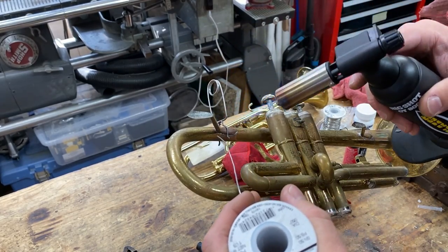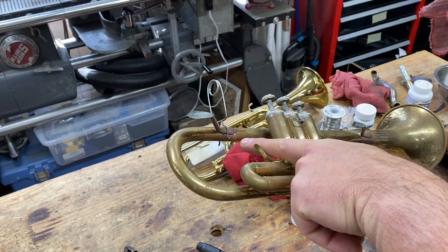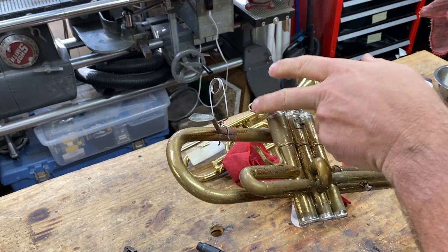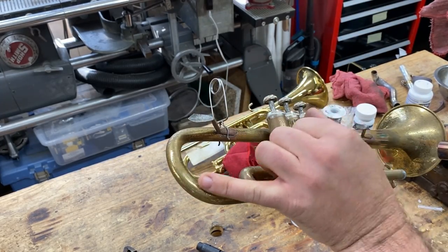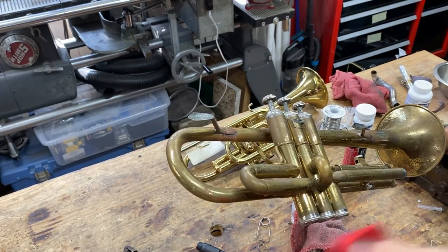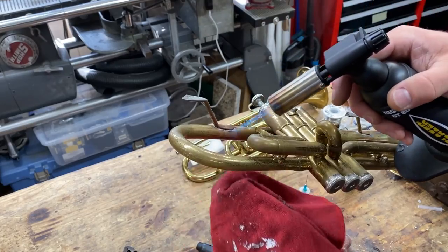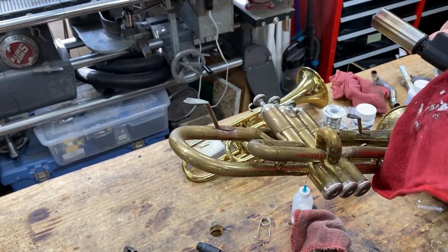Once again, notice I am not heating the solder. We had a little bit of run out here, but the horn is hot. Here's hot, it's hot, ouch. It's hot here. So while this torch was fast, it heated a very large area very quickly. We're going to neutralize our flux and then we heat and wipe. And when you're using this torch, there's not much to that heat and wipe.